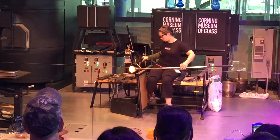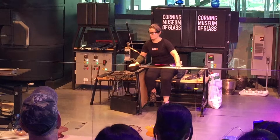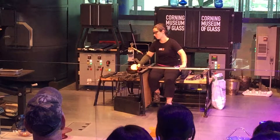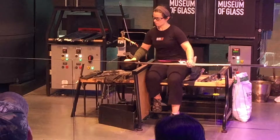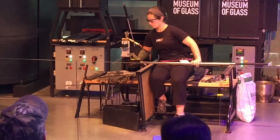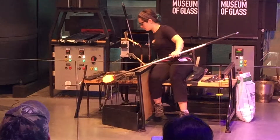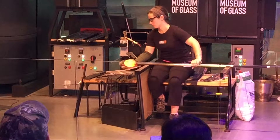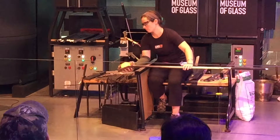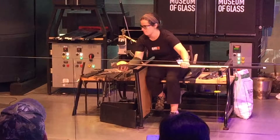This is how we get bigger glass — we have to add it in layers because the glass is too viscous, very similar to honey, to get a large quantity all at once. You start with a little bubble, add a layer, and shape it using a cherry wood block that's been soaked in water. The glass rides on a cushion of steam generated from that water touching the hot material. For an even bigger piece, we let the bubble cool, shape it up, then go back into the gathering furnace and emerge with two to three times as much clear glass again.